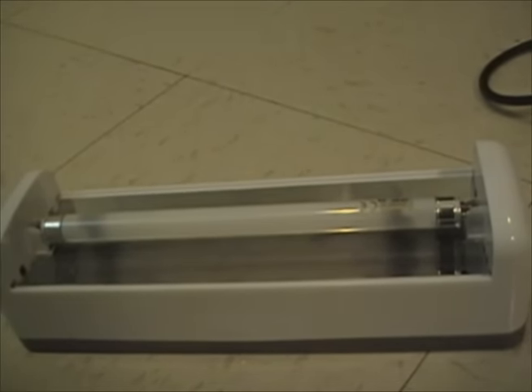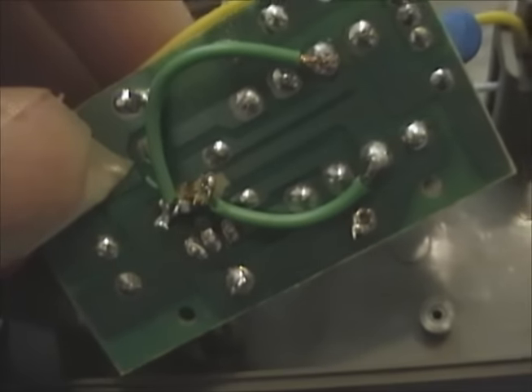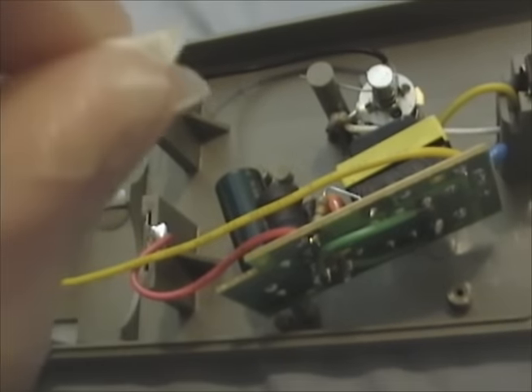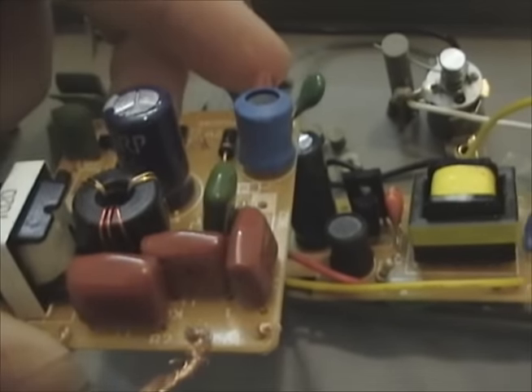I am not having very good luck today. It doesn't look good for this ballast. When I apply power to it the transistors get warm, so it is getting power. I checked all my connections and they're all fine. I've also got a band-aid on now - I slit my thumb just by opening this up. The transistors get warm and continuity checks out for everything. I checked the inductor and that seems fine. I don't have proper equipment for checking capacitors and I don't have any ceramic capacitors I could replace these with. I think it might be curtains for this one - that makes two fluorescent lamp ballasts so far that I have not been able to fix.